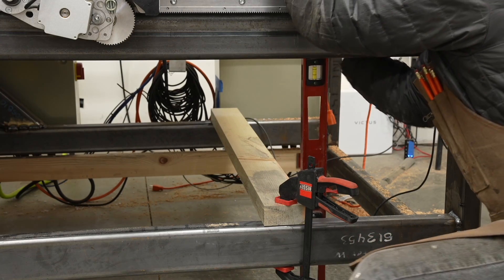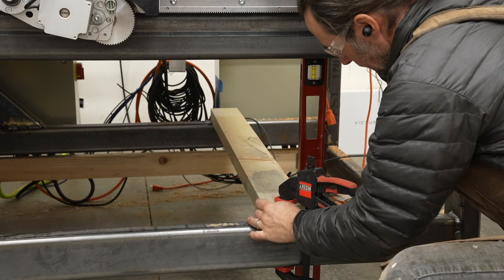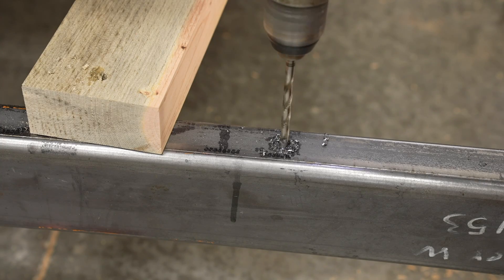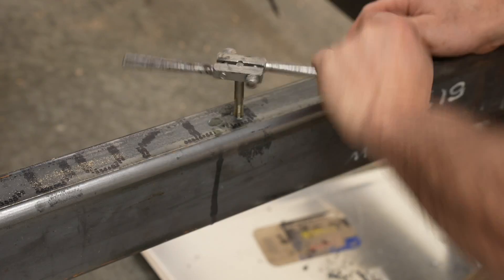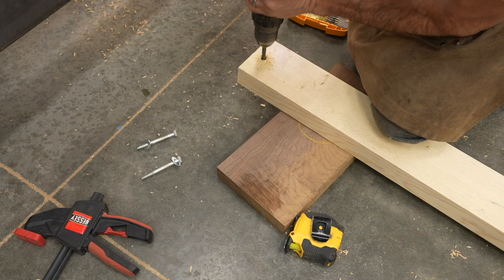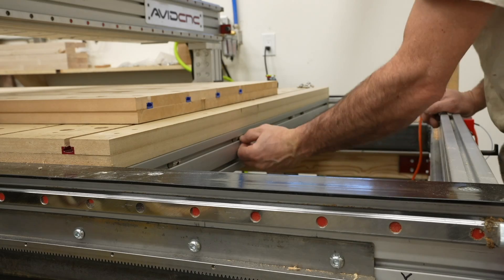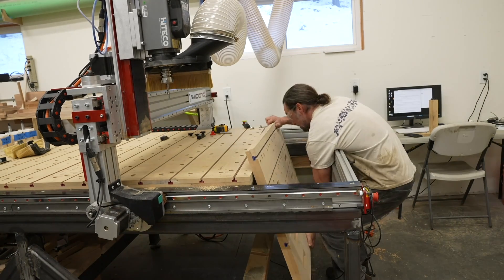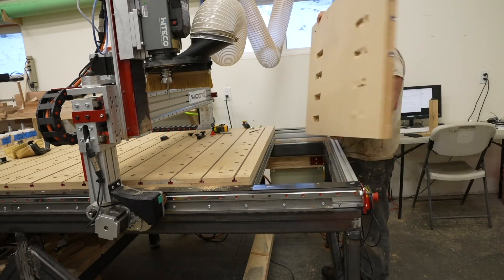My plan was to use the top aluminum 8040 extrusion on the CNC table, put T-nuts into it, and screw those into the top. But since I welded my own base I didn't have any extrusions on the bottom to attach to, so I grabbed a piece of wood, machined it really flat, and put it against the bottom. I put it roughly level, drilled a hole through to mark where it would line up, then drilled and tapped the steel with threads. The wood I cut a slightly larger slot for some adjustability. For the top I slid T-nuts into position at each hole location. I figured I could just hold the vertical work table in place and put the screws in, but MDF is super heavy and that just wasn't working.